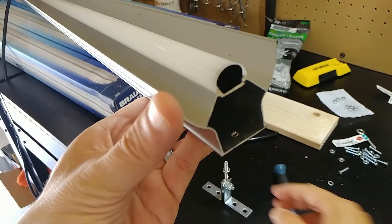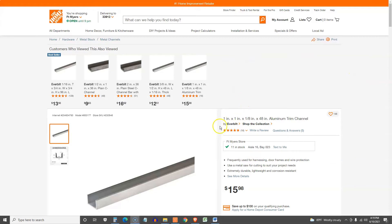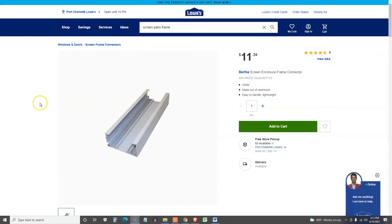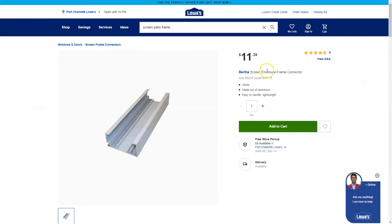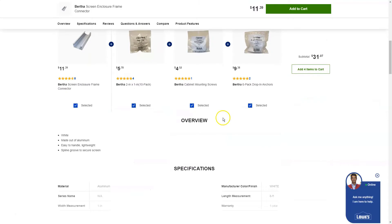Let's take a look at this cross-section of the Harbor Freight shop light from one of my earlier videos. What you're seeing is a piece of extruded aluminum being used as a heat sink to hold a strip of LED lights in the center. To accomplish something like this, I could have picked up a 4-foot 1-inch channel and called it a day, but the $16 cost would have put a huge dent in my budget. Instead, I opted for an 8-foot screen enclosure frame connector from Lowe's costing less than $12 — in other words, the build cost for each LED light fixture is around $11. I haven't seen a 4-foot 5K LED light fixture that cheap. With that said, let's get building.